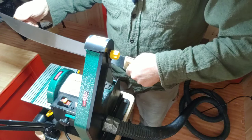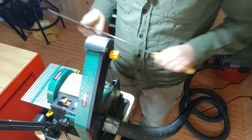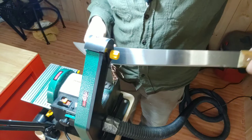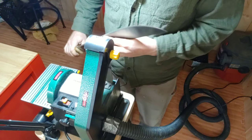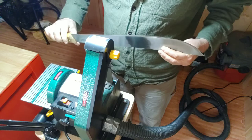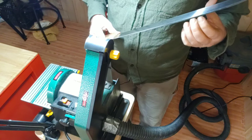I'm checking for a burr. I don't have it the whole way yet. You see a bright spot — and it's gone. I'll check this side one more time, a little bit right here. I'm going to touch that, and you'll see the burr rolling up — so we're good.